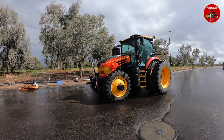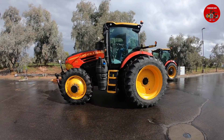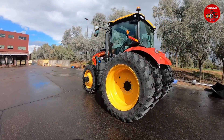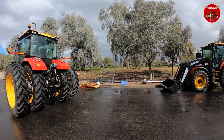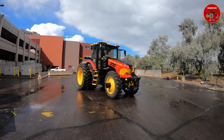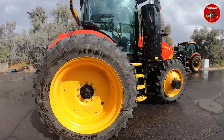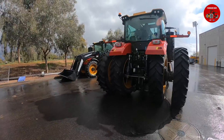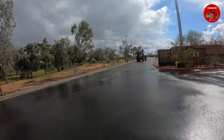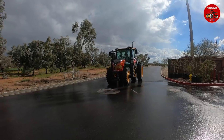Here's just a couple shots of us driving these tractors around the parking lot. The smallest model is going to be a 175, then 195, the 210 you see here, and some other models. Lots of options — including the front PTO and three-point, which I'm excited about. Get some of these out on some triple mowers, that'll make some good YouTube videos. I've known about these tractors for a little bit — I went to Germany last April for the transmission training. The rear end used in these tractors is built by ZF over in Passau, Germany, and of course this is powered with the 6.7 liter Stage 5 Cummins engine.